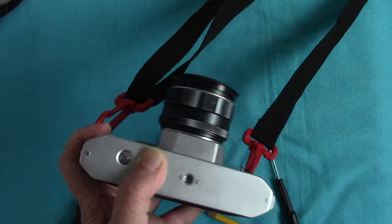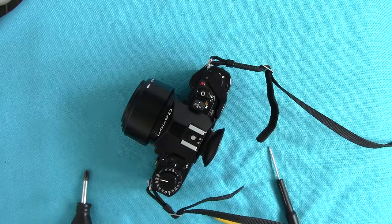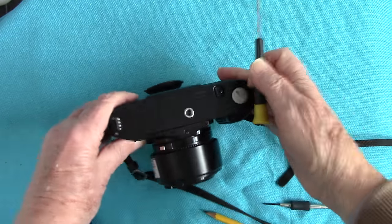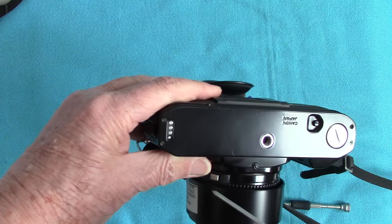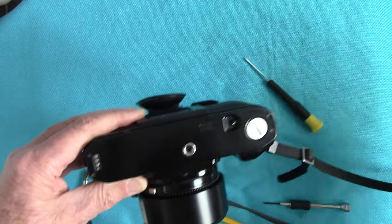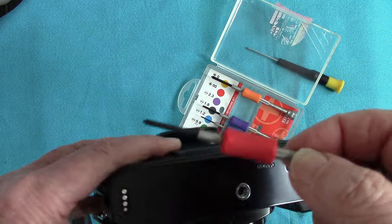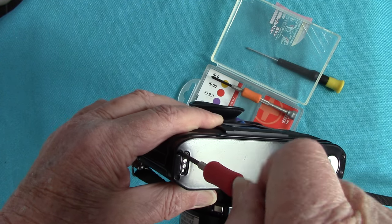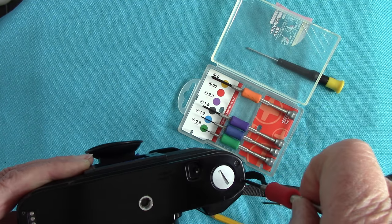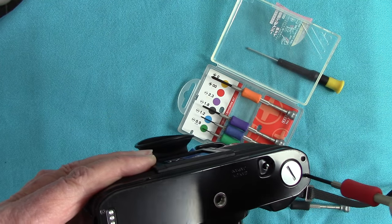With the Canon A1 I had this base plate off loads and loads of times because of the dreaded Canon squeak, and finally managed to do it properly. Now there's a British cross-point one — there are two screws here and you can see it is not turning. It won't turn — you think it's the same but it's not. Now with the proper Japanese one — I think it's a double-zero size — that goes in, look, it undoes the screw perfectly without damaging it. But the British one, which is like a Phillips, wouldn't move it. I didn't want to use any force, so I finally got the right set for nine pounds.